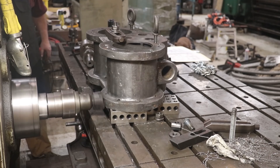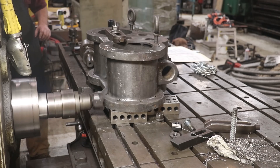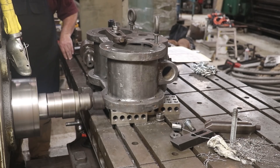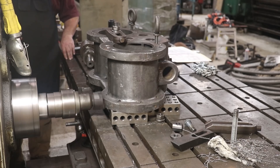We're just trying to put some flats on these four points here so that we can flip this thing 90 degrees and be sitting down on something. Just barely wanting to touch them because we've got a raw, rough casting right now. We just need a tiny amount of area there to clean up on each of those four places and be in the same plane so that we can bore this thing.